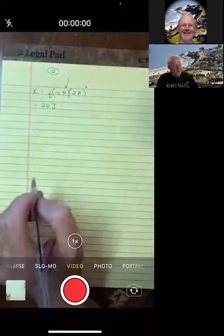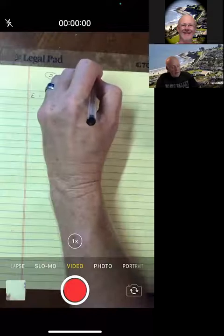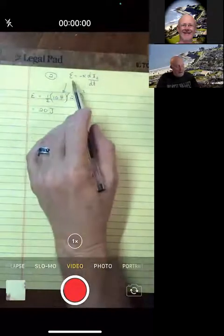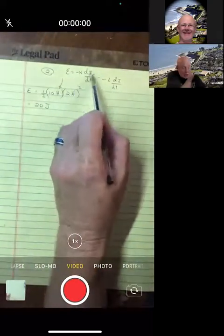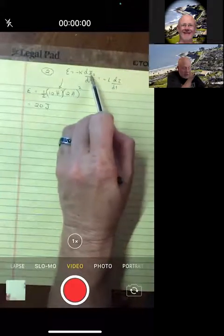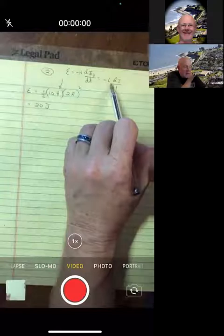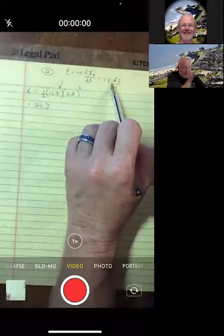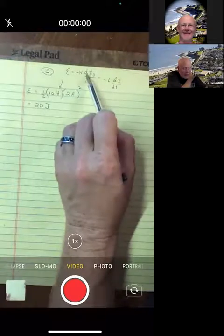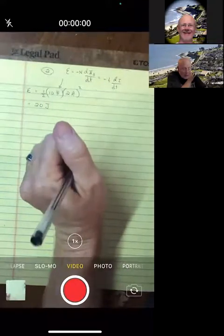And a Henry comes from the definition of the inductance. Quick call out here. An inductor gets its EMF from the change in the flux. And the change in the flux comes, in a circuit anyway, from itself. So as we work through how much the flux, we'll see that the flux actually comes from current. And the reason the flux changes is because the current changes. So everything else in the flux, like the size of the solenoid, what shape is it? Is it a solenoid? Is it a toroid? Is it a coaxial cable? All of those factors that have to do with the flux can be pulled out into the number of turns and buried into this L for the inductance here.